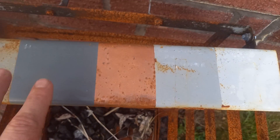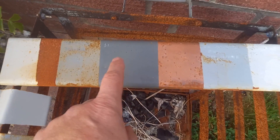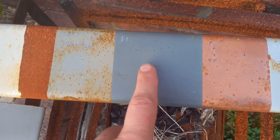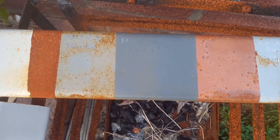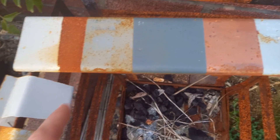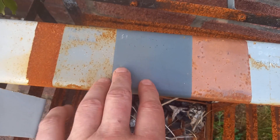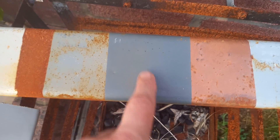They've allowed the moisture to come through. This has just been sat out here since the end of January. So far, the cheapest of the paints is performing brilliantly — that's around six months of pretty grotty weather, only recently has it got tidy. I'm putting quite a lot of faith in this one. It must be a fairly high zinc content, acting like a cold galvanize, because it must be letting moisture through since it's not an epoxy paint, but it's performing brilliantly.